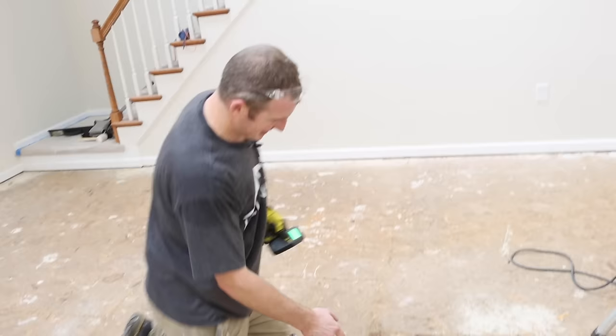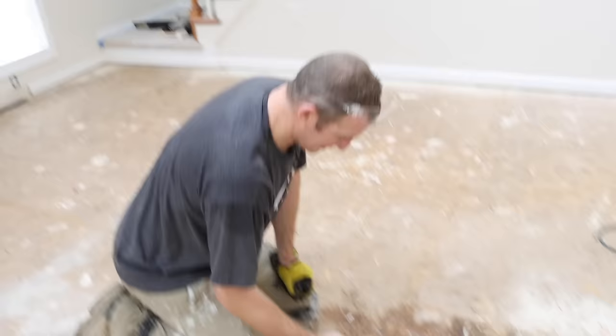I spilled some water here earlier. This will be something that wouldn't be recommended to go over. This is such a small area, it's not going to be a big deal and it'll dry out. Yeah, so it's high. So that's saturated. So you hear that beep. That means you would not be able to go over this.